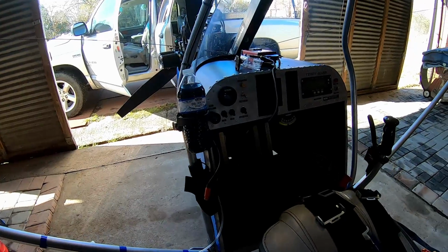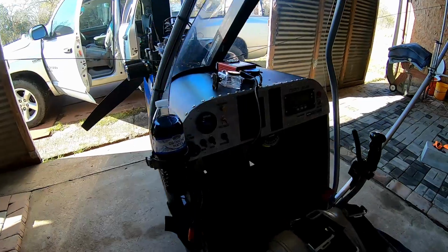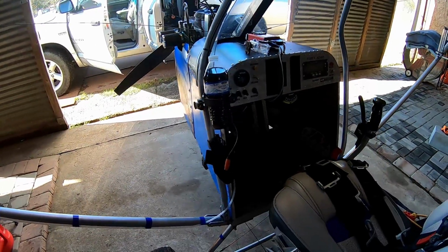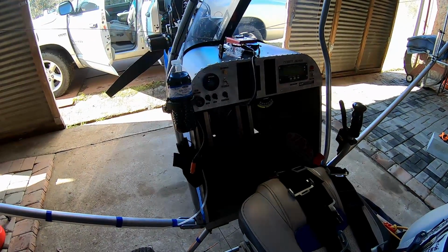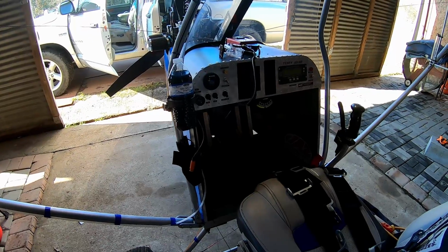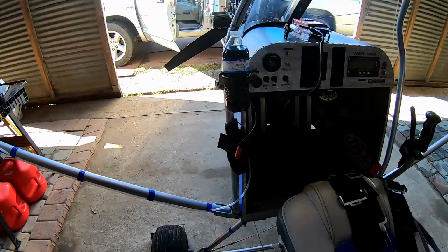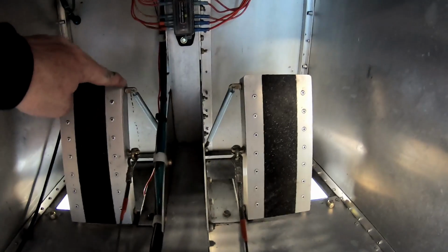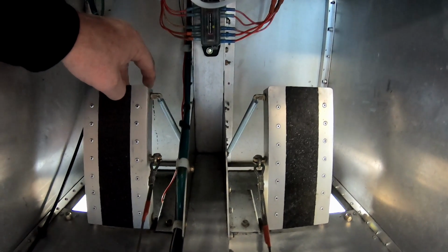When I got out here this morning, I had a mission that I had to do. As I was flying on my last shot there at NASA, we did the NASA flight, I noticed that Tango Alpha 1 kept favoring a right turn whenever I got off of the rudder pedals. So my first inclination was, dang, this is a strong wind. But as it turns out, it wasn't a wind at all. What had happened is one of the springs, the return springs on my left rudder, had broken loose. And it was right here.